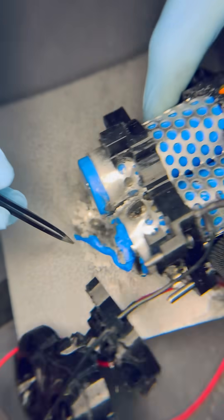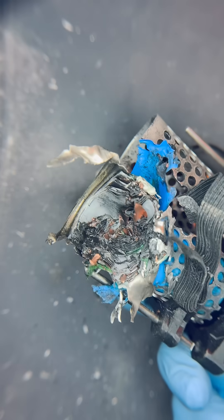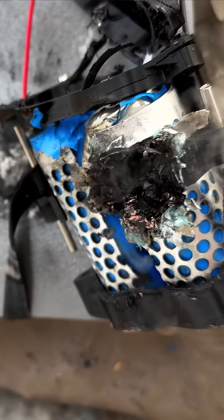But overall this is a big success and did prove that we can get away with a lot lighter armor, because these cells end up taking so much extra energy out as the round tunnels through all the extra layers in these lithium iron phosphate cells, which, as you may have noticed, are nowhere near as combustible as the lithium ion counterparts that we often see.